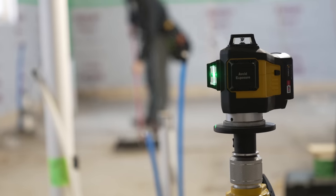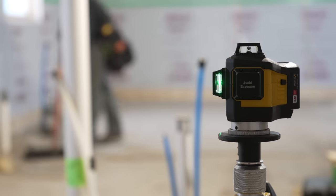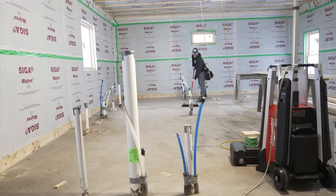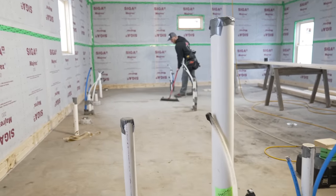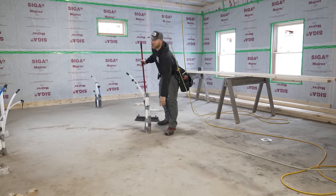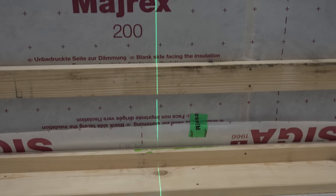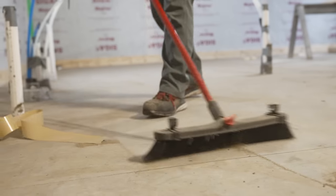This wall right here is the most important one — it's the longest and straightest. Once I get that one up, I think the other ones will all come in pretty easy. I don't have to snap any lines because I've got my laser set up, and this laser allows us to also do our top plate. We're going to frame bottom plate, top plate, and then come through and stick all our studs in at the end — we're not going to be able to stand this up as one wall.